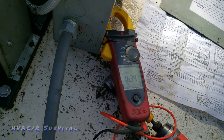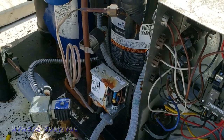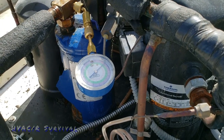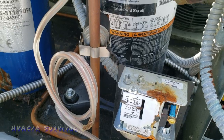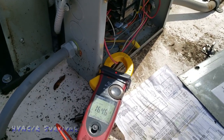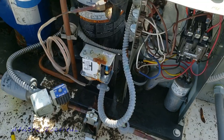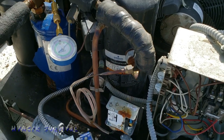What I ended up doing is I jumpered that out - it does peak to 23 amps but then drops down to nine because the relay is kicking out the electric strip heat. I want to make sure this thing comes back on, but I do know that on the pump-down before that it did a lot of clicking and was set at about 15 pounds, so there is a chance it could have come back on. At this point you're kind of shooting in the dark, hoping to find out exactly what caused it.